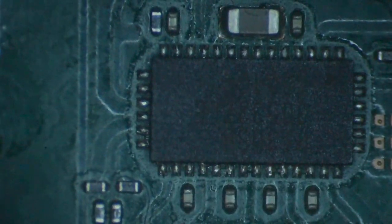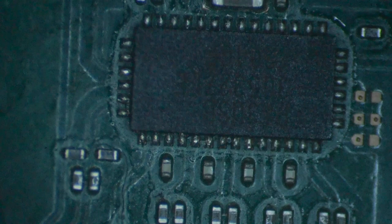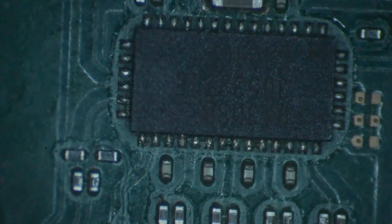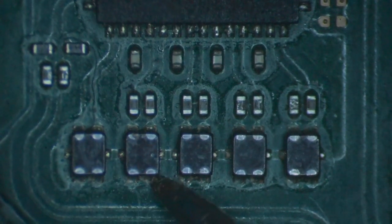Now let's check our BQIC for any shorts. Our BQIC does not have any shorts. The next one I want to check is P13 USB. We'll put our probe on ground here — that's our ground. That's the line where usually this capacitor right here is going to be shorted along with this capacitor right here. If this capacitor is shorted, usually this one is also shorted on this side. In one occasion I actually had one of these filters shorted to ground — the short was coming from the chip, but the lines were shorted. So let's check these — no shorts. Let's go ahead and plug in our switch and see what it does.